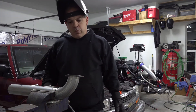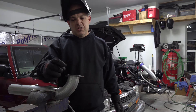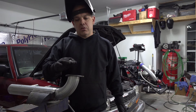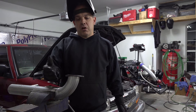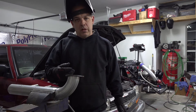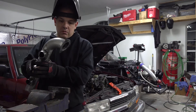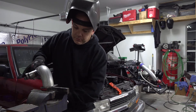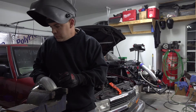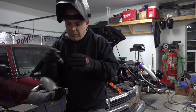We got the inside of it welded up. Now what I'm gonna do is flip it over and weld a small section in between each bolt so that way when we dress it off on the belt sander, in case there's any thin spots or anything like that, it'll still be welded on the other side.